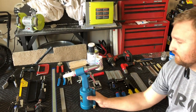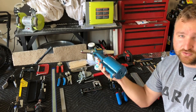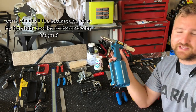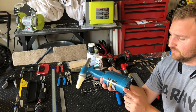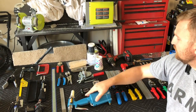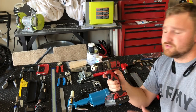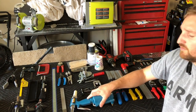I can't rave enough about the pneumatic rivet puller. I bought this at Harbor Freight for around 30 bucks — they always have coupons. I started the empennage just hand-pulling and didn't want to spend 300 to 400 bucks on a puller, but once I found this one there's just no way I'd do it differently. Go out and buy a rivet puller from Harbor Freight — 30 bucks. You can even get a Milwaukee or Ryobi kit attachment as well.